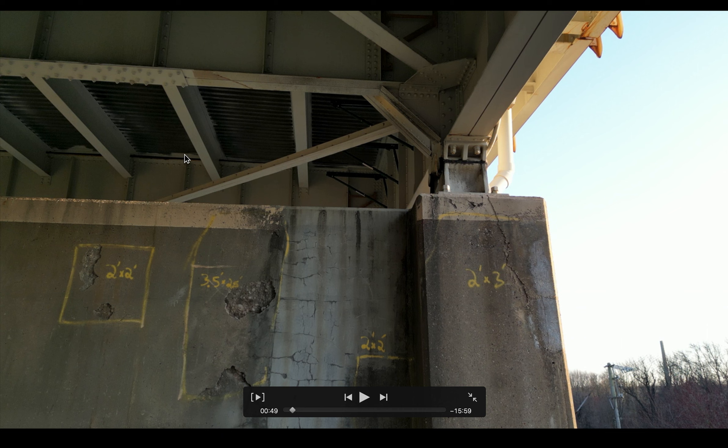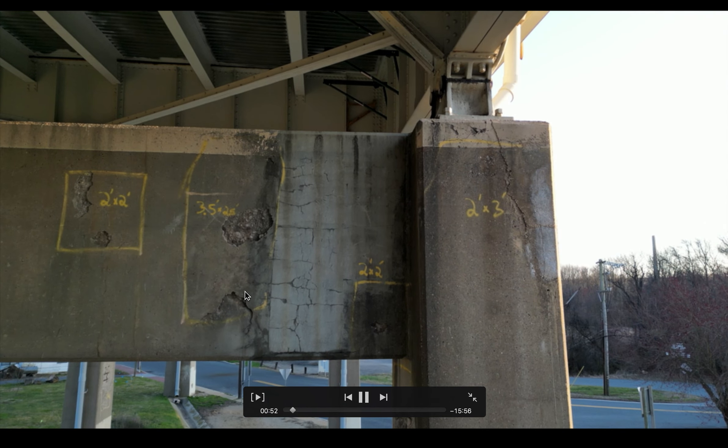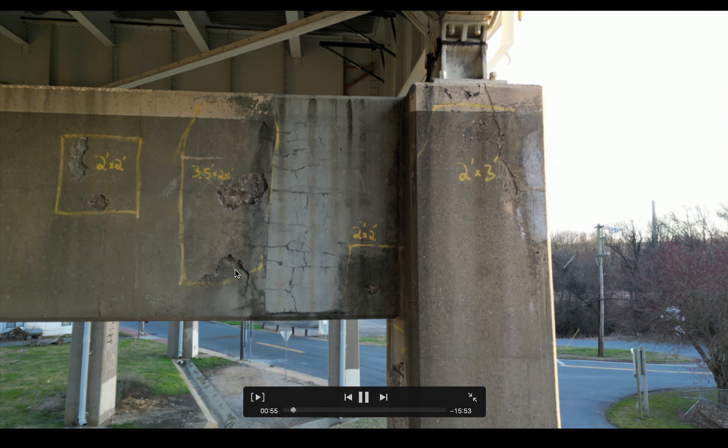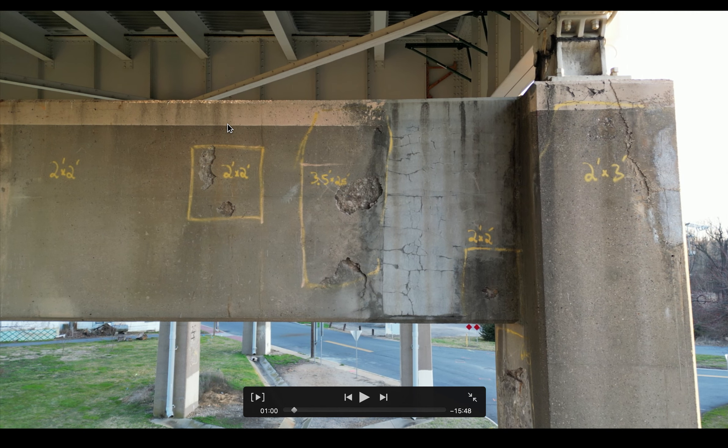It looks like they've been doing some steel work and painting here at one time. There was some lead removal done on this bridge back around 2000. Again, there's spalling. The repair sizing — it looks like somebody put their foot in it, but in reality it's flaked off. You're seeing a straight line here, but this is not stress from overloading because there's no load on top. It would be compressive strength or tension on this beam. This is more the surface concrete over these many years swelling because of the reaction of the rebar itself and the concrete together — that marriage alone wants to fail.